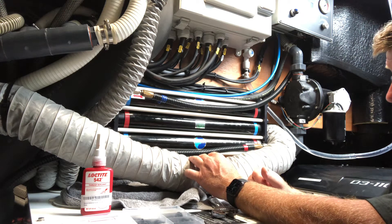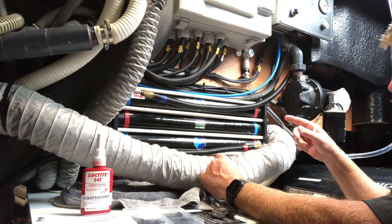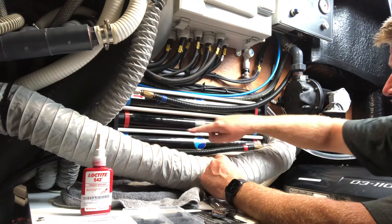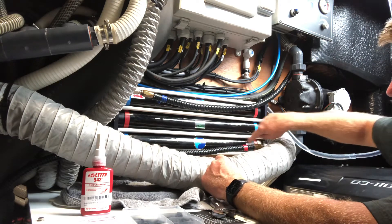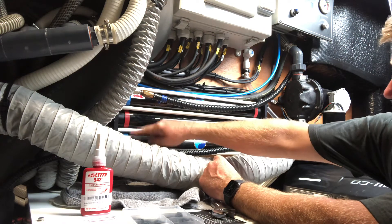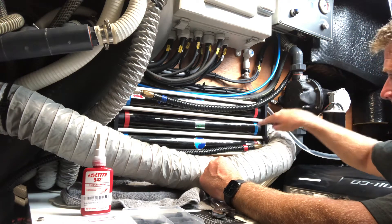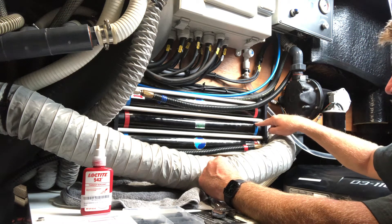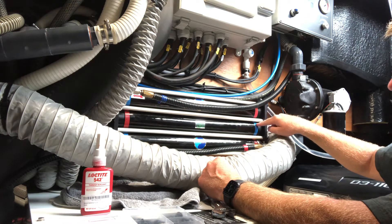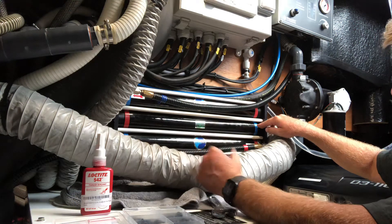This is the second time I had to reassemble everything because of the interconnectors — there's one right here and one right here. The high pressure feed enters and travels in series through the tubes, so the interconnector connects the two or three membranes. It's a male-to-male fitting with two o-rings on each end, so four o-rings per interconnector.